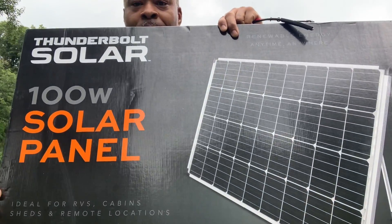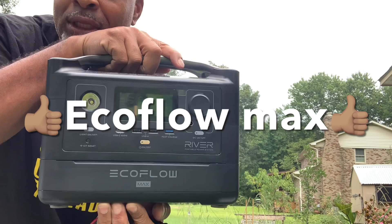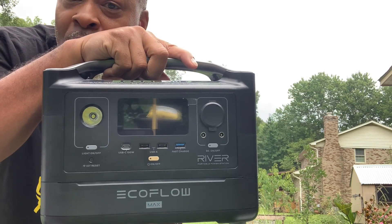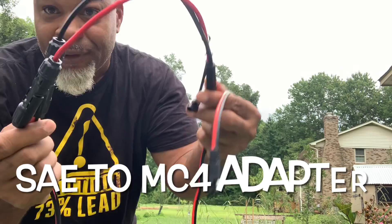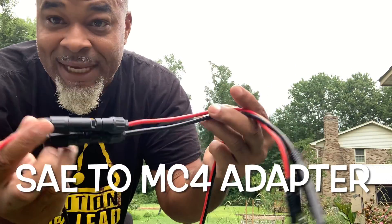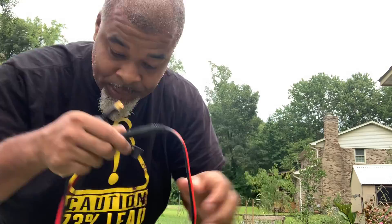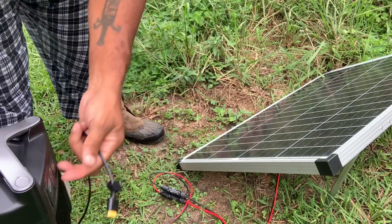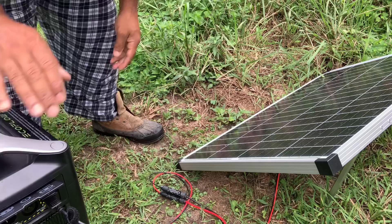I'm about to try out the Harbor Freight 100 watt solar panel. Got it out the box already. Super cloudy outside — I'm going to show you right now how cloudy it is behind me. The sun should be over there right now. I'm going to be using the EcoFlow Max. We're going to see how much juice we pull. I already got the adapter for this — it changes the polarity. It's an SAE to MC4 adapter. I'll put that link below. I'm going to plug that into my panel and plug this into the EcoFlow. Let's see what kind of wattage we're going to be getting, just with it sitting like it is.